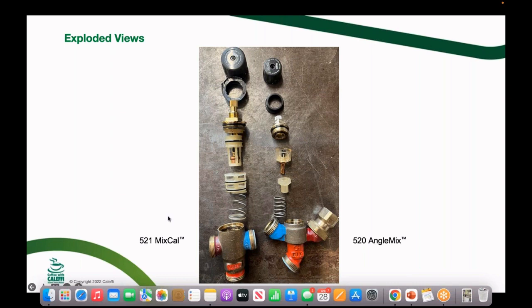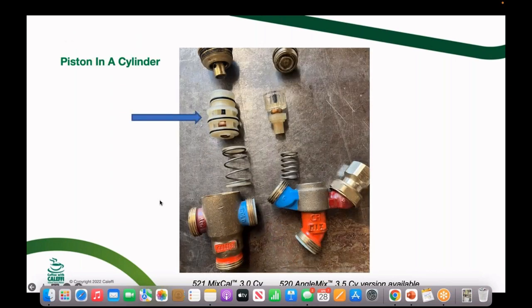Sizing is very important when using a thermostatic mixing valve in hydronic applications. Just because it's a three-quarter inch connection doesn't mean it can support five or six GPM. The Cv from our tech brochure gives you two different ratings for the small and large body versions — make sure to order the larger body for the higher Cv, as it also has bigger connections. The important numbers are the Cv and your design flow rate; from those you can calculate pressure drop through the valve.